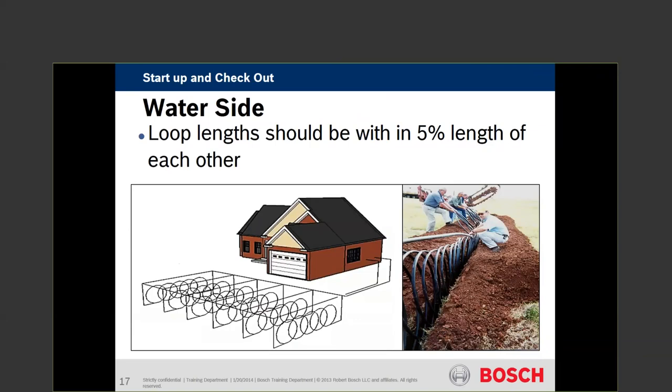The picture on the right is Doc Bowes from the International Ground Source Heat Pump Association. Back in my home turf we have rocks, boulders, tree stumps, and roots. Our loops must be within 5% length of each other. If I have a 400-foot unicoil, that's a 20-foot allowable difference — 5%, meaning 10 feet per tail, 10 feet down and 10 feet back. When your well driller is drilling wells, we've got to make sure those wells are all about the same length, or we consume the tails in our trench entering the building.